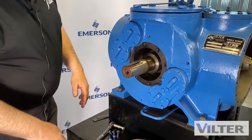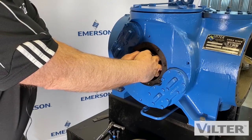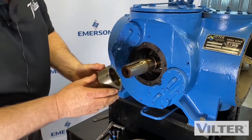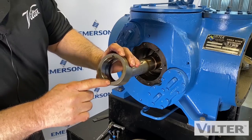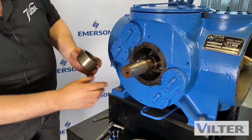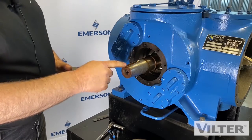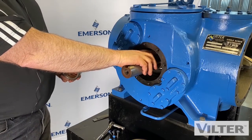We don't want to touch the seal face with our fingers. This will also come with the seal kit. I'm going to pull this out — in the field it might not be so easy. There's an o-ring in there which will sometimes bind. Also, we have notches on the end — that's for anti-rotation. There's a pin inside here that locks and lines up with that slot. That pin is in direct line with this keyway — there is an anti-rotation pin in there, it's a roll pin.